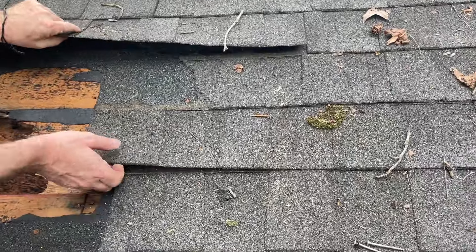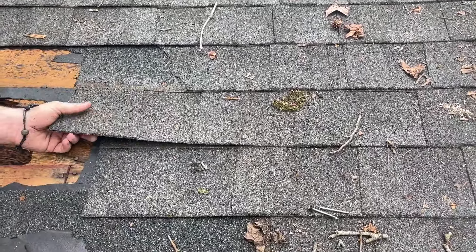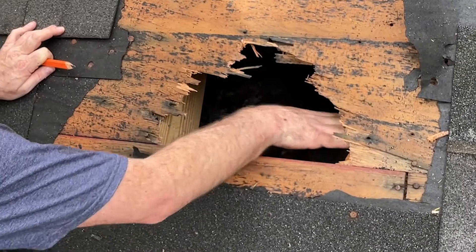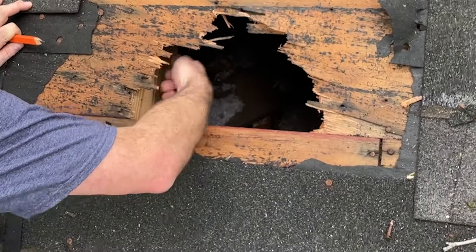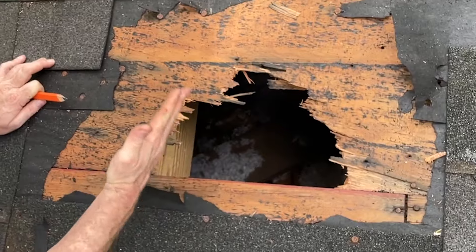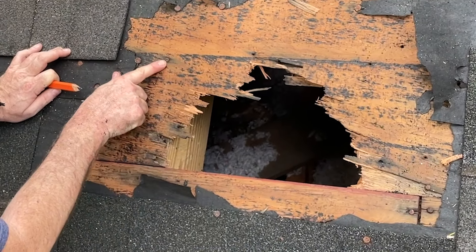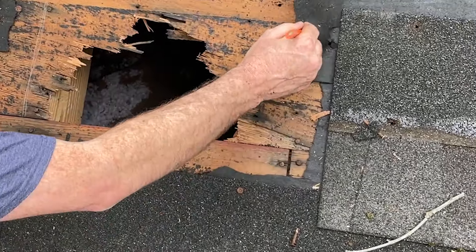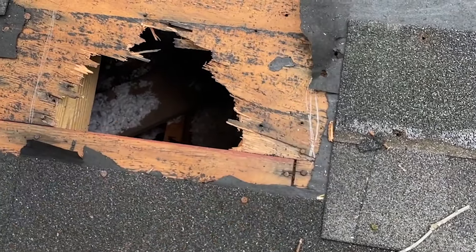This shingle is ugly so I want to pull it too. In order to fix this sheathing, we're going to have to treat it just like a floor. We've got a rafter right here, so we're going to need to cut it right here. I can see there's a nail holding the plywood down — that means I know there's a rafter line here and there's going to be another one right here. So I'm going to pull those nails out before I try to cut it.